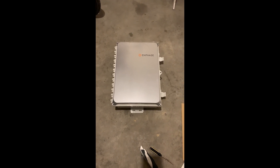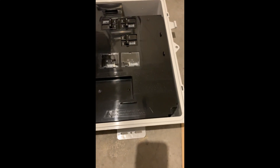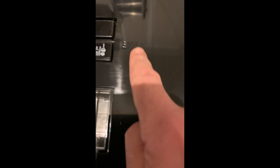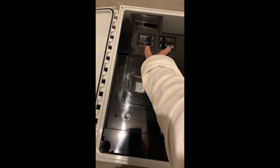I just got it, just opened it — this is what it looks like. I'll walk through the main things to get it set up and running. To open the box there are latches on the side; it comes locked and you just unlock it from the bottom and open it. Inside there is a main cover — very nice and clean. There's only one circuit breaker connected from the factory, and if you look carefully it says Envoy — that's the device that monitors all the microinverters. It comes pre-populated; the other two I just put in.